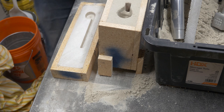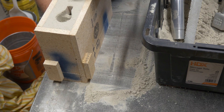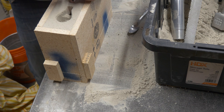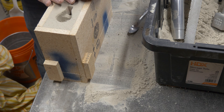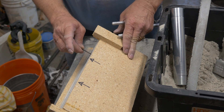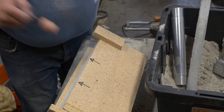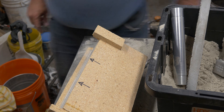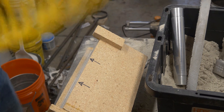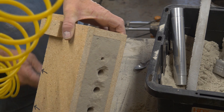I'm pulling the runner out here — you can see how clean the mold is. The sand is really, really nice. I'm using a spoon to dig out the sprues that are sitting below the level of the sand. I stuck a screw in the sprue so I can rotate it and pull it straight out very carefully, not messing up the sides. This is the rapping tool we made in the last video. I've got a screw stuck in the pattern and I just lightly tap it a couple of directions and it pops right out — nice and easy. The rapping tool is really light so it doesn't transfer a ton of energy into the pattern.